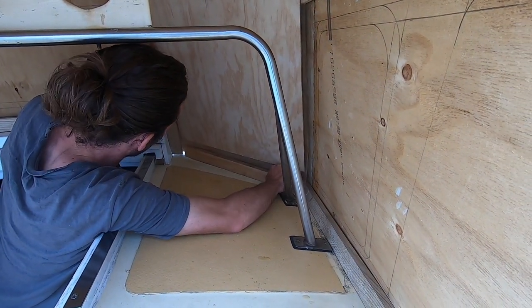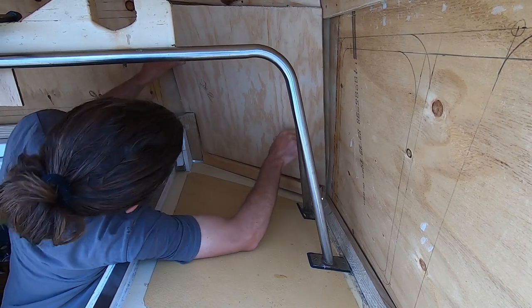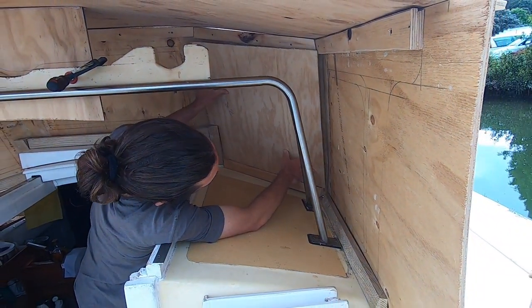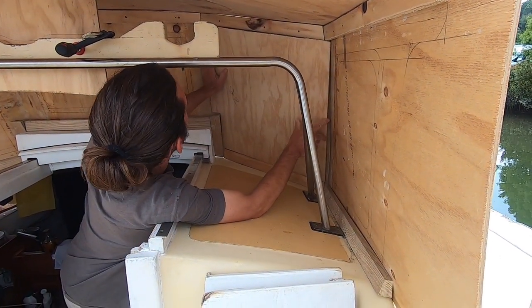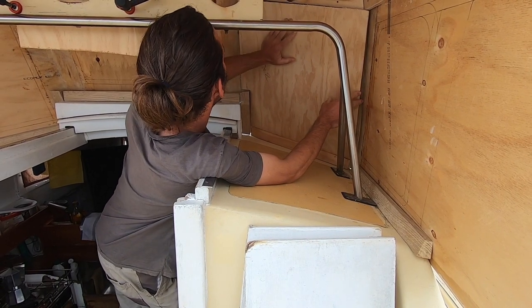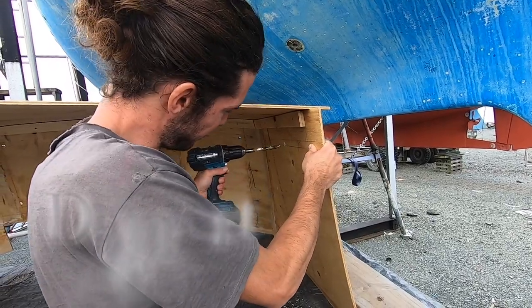Unfortunately, we didn't film that part of the process as all hands were busy. The windows are drawn inside, and then we fit the inside skin, also made of 7mm plywood, which is going to create a rebate for the clear acrylic sheets to sit in.